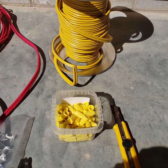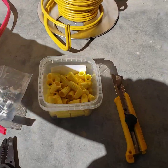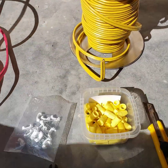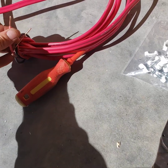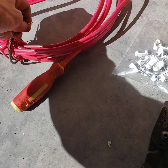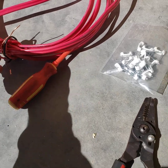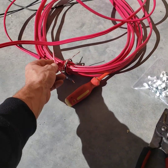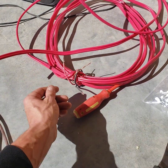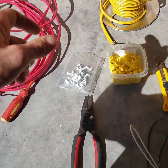This is another 12-gauge 20 amp wire meant more for 240 volts. As you can see, you have black and red and a ground — these normally indicate two hots and no neutral. You can't go and run this wire and try to designate one conductor as white to get away with that; they don't accept that.